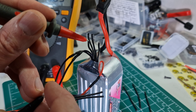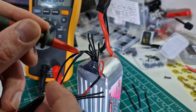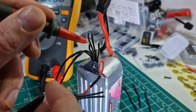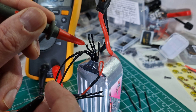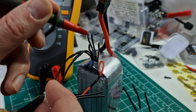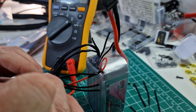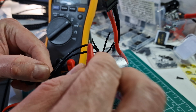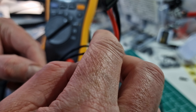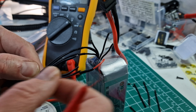You can see what's happening here — we're adding up. Nothing on that first wire, then the voltage for one cell on the second wire, then the third wire shows the voltage for a two-cell pack, then three-cell, four-cell, five-cell, and then six-cell on the final red. Next one's done — going from first negative: that's three-cell voltage, four-cell, five-cell, six-cell. Everything's on target, looking good.